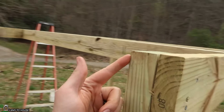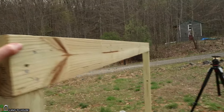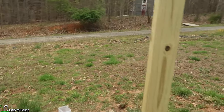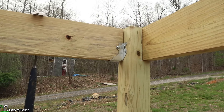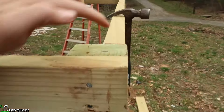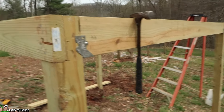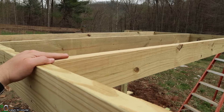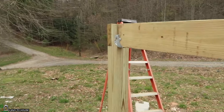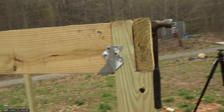I've measured between this inner board and the other, and I've cut that board here. I'm going to be using some strong tie — I just got the 2x4 version but it should be sufficient — and it's going to be holding the board up like this. The reason for that is because I need to have this eight foot by eight foot square, and with the board on the outside it was going to be too wide, but with it right here it's going to be eight foot by eight foot. These cross boards are supporting all the weight, and that's why I cut this into here so it has that support. It looks pretty good — could be a little bit tighter perhaps, but it's going to be more than enough for a playhouse.